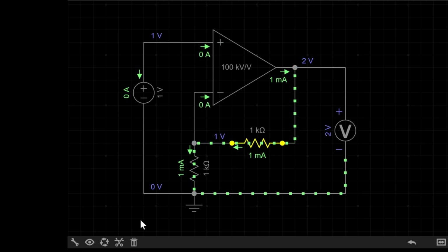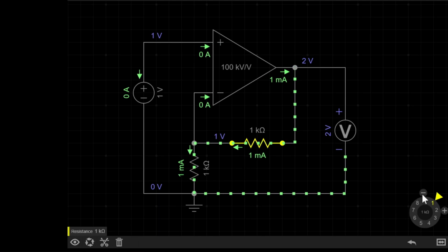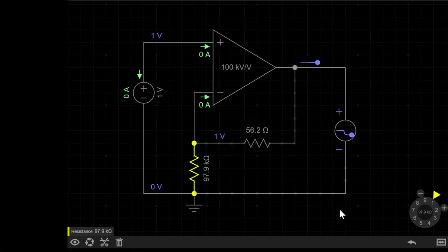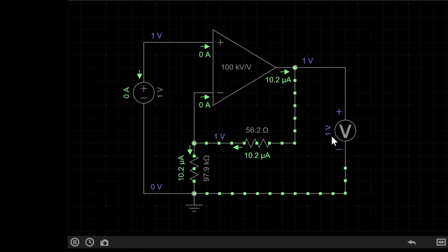Even if I set this resistor to a really low value, all the way down here, and this resistor to a really high value, all the way up here, we can see the simulation comes out as roughly 1 volt. If you really need a gain of less than 1, then you may have to consider a voltage divider. There is a link in the description showing you how to build one. Or, if your circuit has a high resistance, you may need to include a voltage follower, link also in the description. Inverting and non-inverting op-amp circuits are probably the most popular op-amp configurations and are definitely worth knowing.